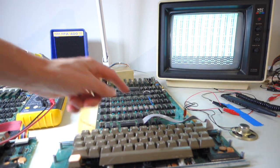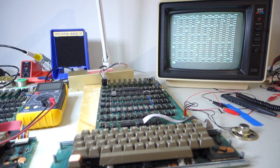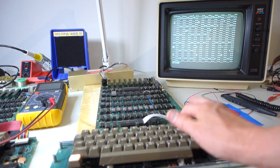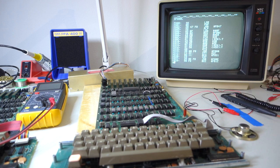Here's the moment of truth. We've got the jumper wire going from ROM D8 pin number three to ROM D0 pin number three, bypassing the broken trace. We'll go ahead and turn it on and hit reset. And look at that — we're dumped into the monitor and we can type, for example, F800 list. And there is the assembly code.